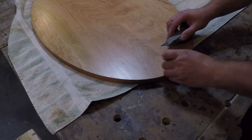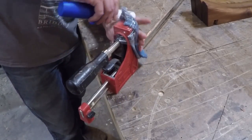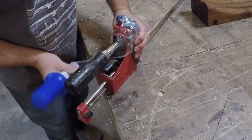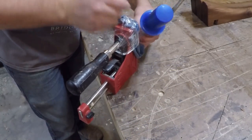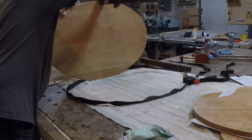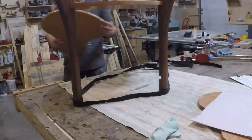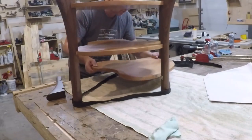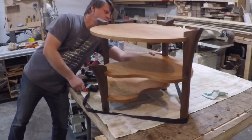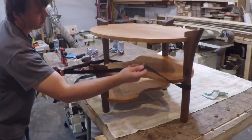After all the parts were finished, I removed the tape and prepped my clamps with some cushioning material so I would not mar the new finish, and went to work assembling the table. Since I had 9 joints over 7 pieces to line up and clamp together, I used a slow setting epoxy. As usual, the band clamp was disappointing, and I abandoned it by the end of the glue-up.